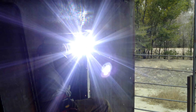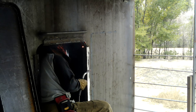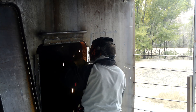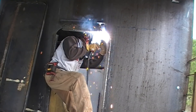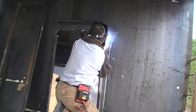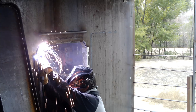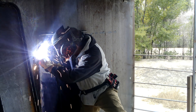What I did was push the knife edge — just inch-and-a-half by quarter flat bar — up against the door, then tacked it into place. I cut slots in the hinges so there's about a half inch of play for the door. When I pour in a half inch worth of gasket material into the door, it'll push it away a half inch. As the gasket wears out, it will move closer and closer until the steel knife edge can literally touch the steel door.